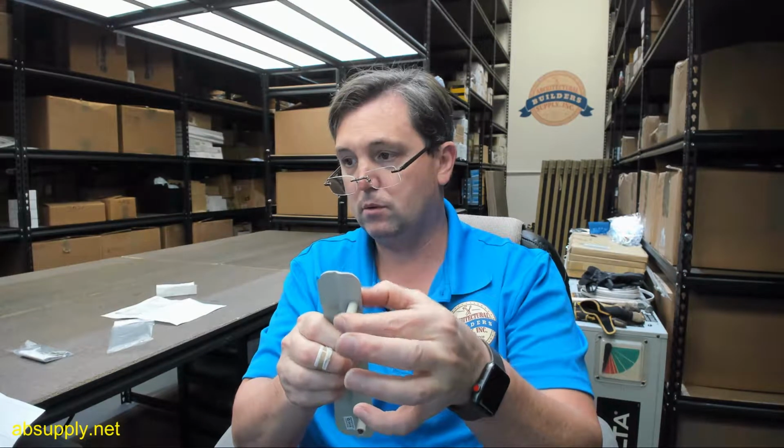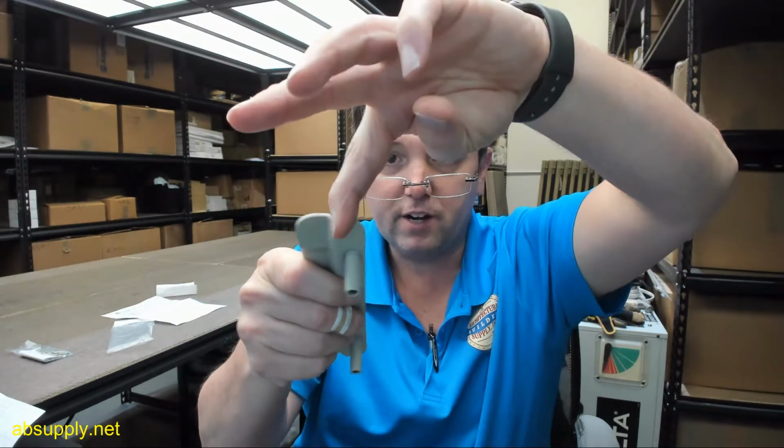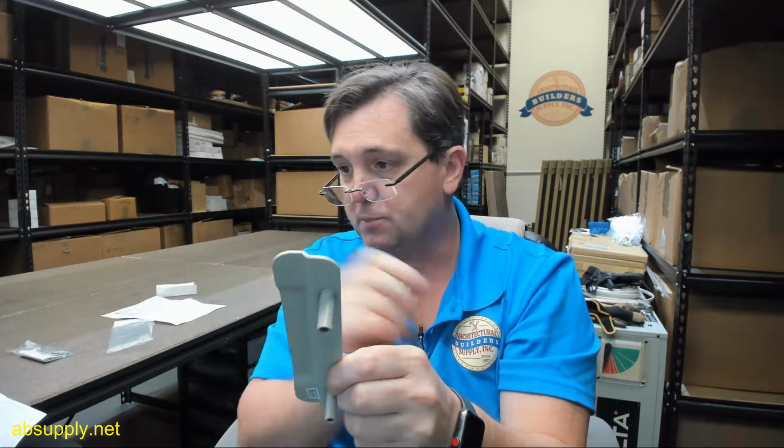So that's going to tell you from the edge of the door to where you are attaching these bolts, from the edge of the door to the center line of where the bolts will be, that's your 3/8 of an inch. And this portion obviously overlaps the face of the frame, and it has that offset that's there to accommodate the fact that hollow metal frames are, as a rule, inset ever so slightly.